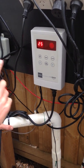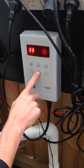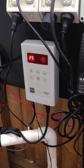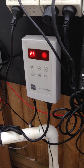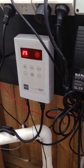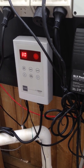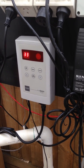The other things we can do with this is set a temperature limit. By pressing the temperature button here, we've got a temperature of 33 as our limit. We normally set it around 30, but you can change that to whatever you want. Once the solar temperature of the water gets to 33, it will automatically turn off and maintain that temperature. If I want to change it, I just go to the down button, set the temperature to 30, or up, back on to 33. So that's the set temperature.